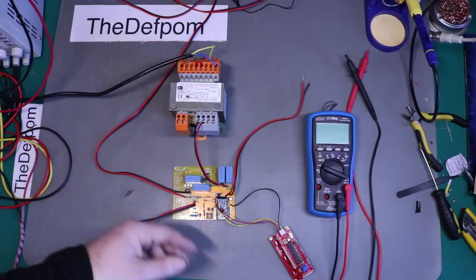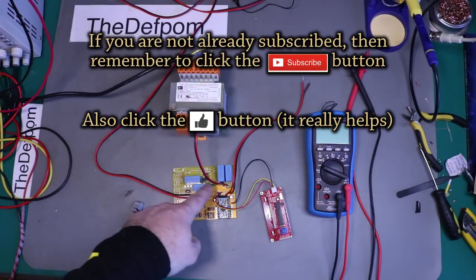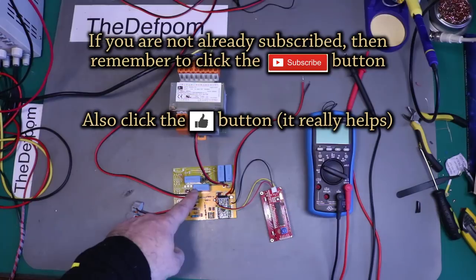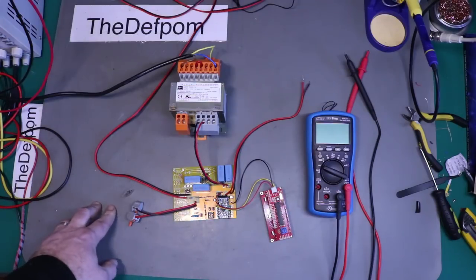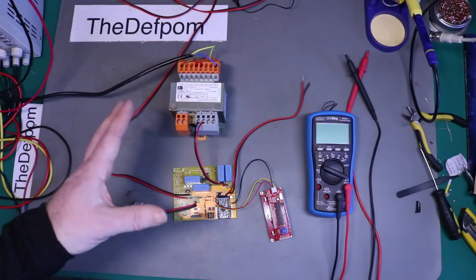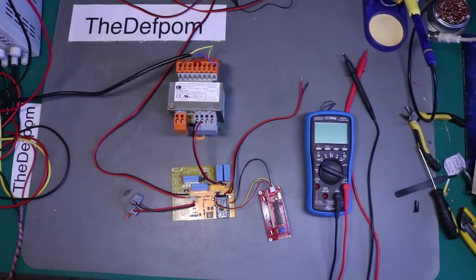It's best I do the development and figure it out rather than someone less familiar doing it, because I don't want anyone killing themselves. It might even be possible to move a capacitor to a different place and skip a stage. I think 500 volts or so DC is plenty - I really only want like 450 volts, with 500 as the top end limit, and I think I'm going to be able to do that.